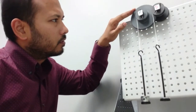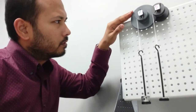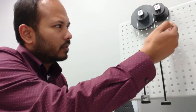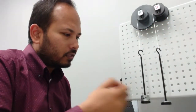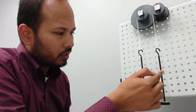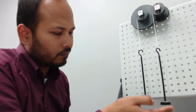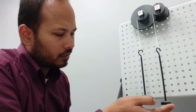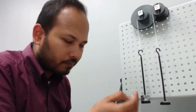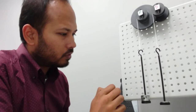I put both wires on the same side of the gear so that they are balanced. I balanced both gears using different weights because their sizes are different. On the driver gear I just have to put a 10 gram holder and a 10 gram weight, so I have 20 grams on this side. On the other side, to get balanced weight, I had to put 70 grams total.